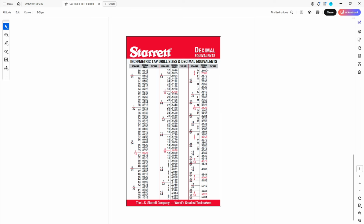So we're going to plan around that. We're going to use the 246 drill. That should still be within tolerance of our plus or minus 5 on the 250. And if it isn't, we can always go back with another reamer for that one. But we'll be running that outer pattern on the low of the tolerance on purpose, so that we don't have to put an additional tool in the machine and cut it.